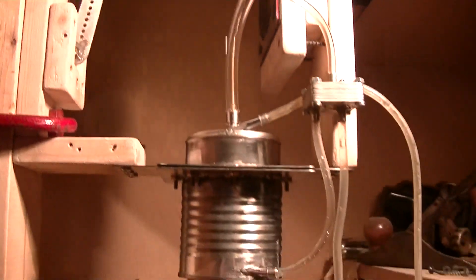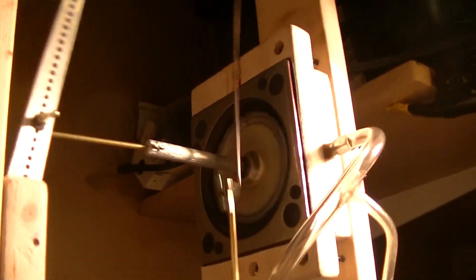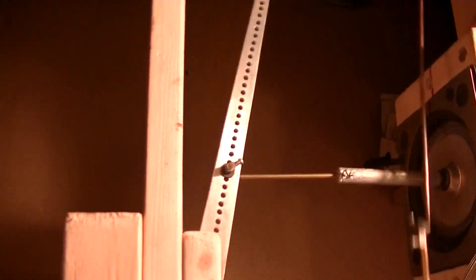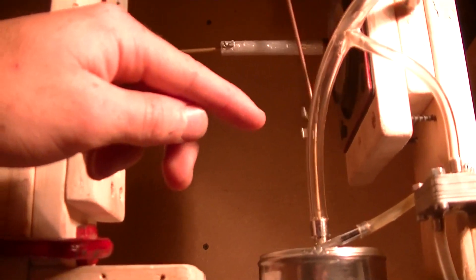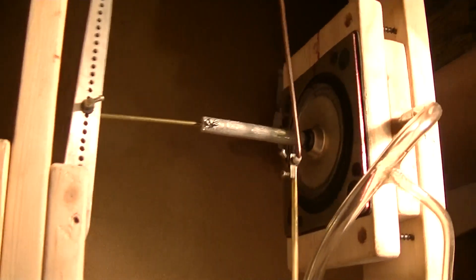This is awesome — I'll have to watch the water cooling there. This is amazing. Looks great, makes a very nice sound. Might need to redo the diaphragm because it does seem to have a bit of wasted power there when it flaps like that. I also need to adjust this and get the optimum performance for the temperature. For a lower temperature there's going to be less air moving in and out, so I could move this down and it would still run. But for a higher temperature you'd want to move it up a little bit, but not so much that the piston wouldn't work.